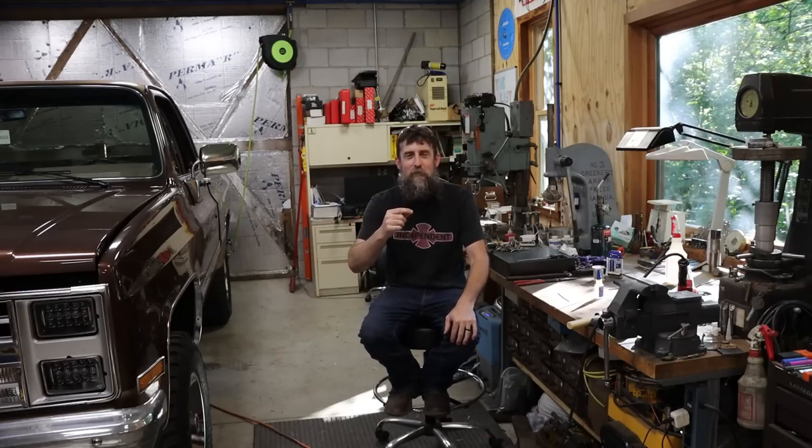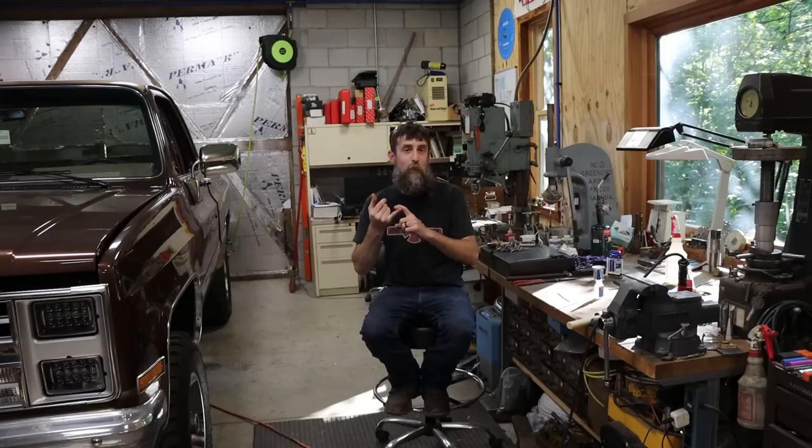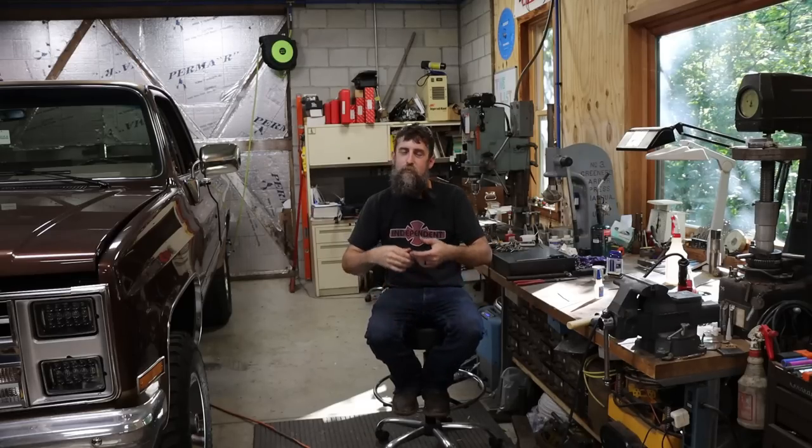So there is no doubt that using coolant is a messy business, but it does such a good job of keeping accuracy, like on a surface grinder, keeping your parts cool, keeping your cutters lasting longer on a milling machine or whatever. And if you can get that coolant directed where it needs to go, you can use less of it and get the same result. Keeps down the mess. Plus, some designs, maybe like this one here, may be a little safer than something you would use otherwise. Definitely safer, I think, than what I was previously using.